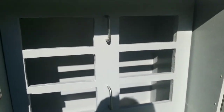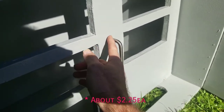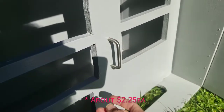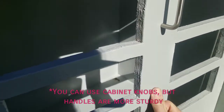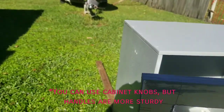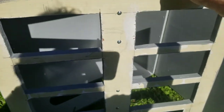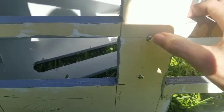On the inside here, this is the panel that's going to hold all the outlet boxes. Now once you get all the outlet boxes in, you're not going to be able to grab hold of it and pull it in and out to adjust or fix anything. So what I did is I got some drawer pulls — these are a three-inch spacing. Just measure out three inches, drill your hole, put your screws through it, and it catches on the inside; it's threaded on the inside. Now when I've got everything in there, I can just grab hold of it and get to the inside of my box, or I can work on the back of the panel.